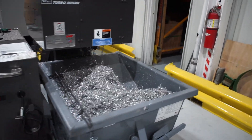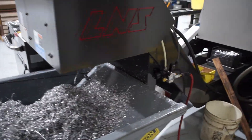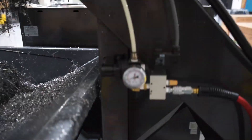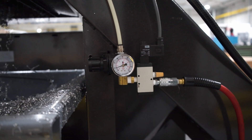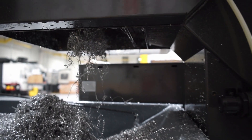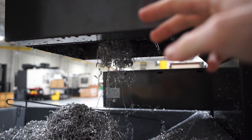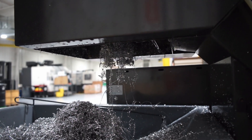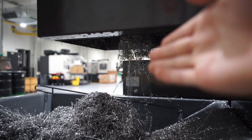The next thing I do for overnight runs is come over to the chip conveyor and make sure my air knife is plugged in. You can see the red hose running to air pressure — I have it set around 20 PSI, which is good enough to blow chips off. Essentially there's a tube that blows air over a metal knife to keep chips from building up. Without it there would be a lot more chip accumulation.